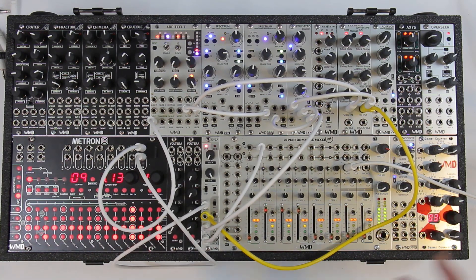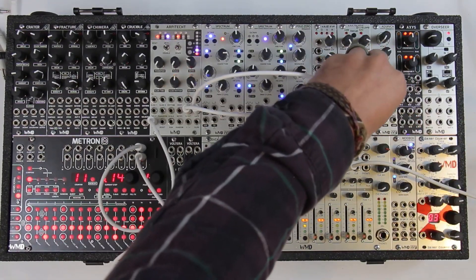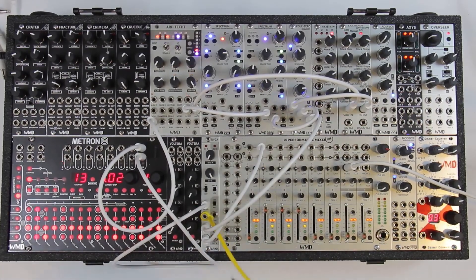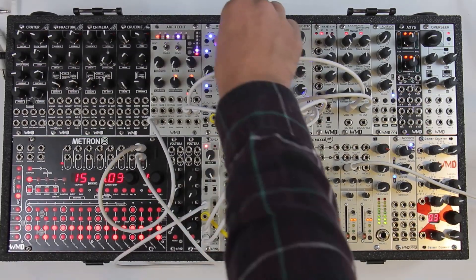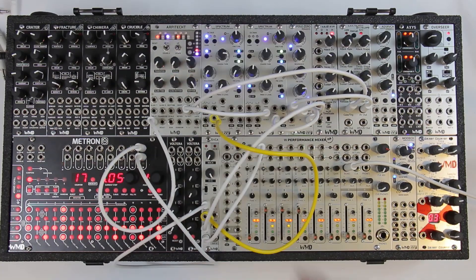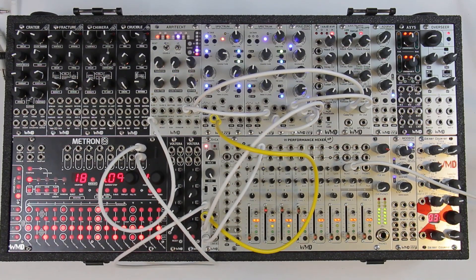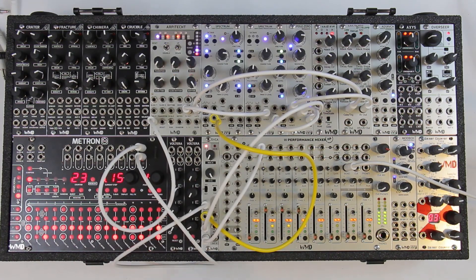It's definitely not the most useful thing in this scenario. So instead of using the envelope output, I'm just going to run an LFO into this — this is from my other Spectrum. I'll turn it up a little bit, make it a little bit faster to make it a bit more random. Now we're getting stepped voltage, stepped VCA levels — stepped volume levels. This isn't going to do anything for our clicks or pops because we're no longer using the zero crossing detector.